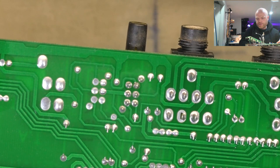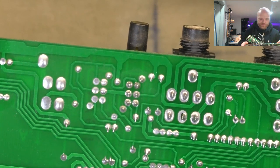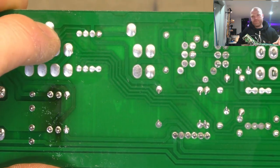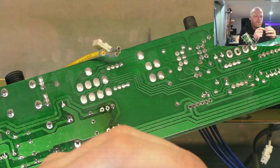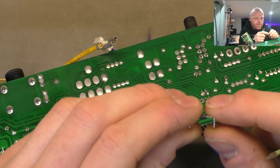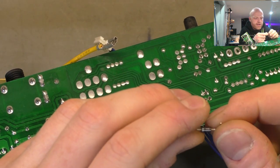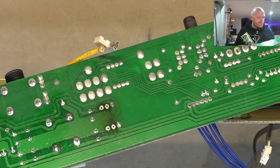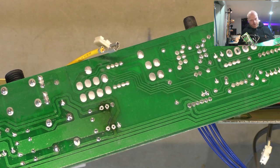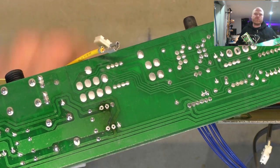one that looks pretty good, or the front panel control PCB that looks good-ish. So they are BZY97C15, so 15 I guess is the voltage, plus minus 15 volts. That makes sense. We'll double check the schematic, but I've got 5-watt versions of them in stock.